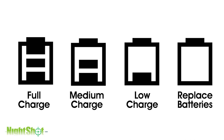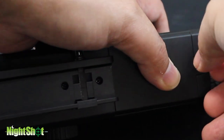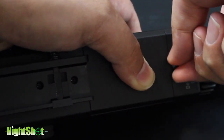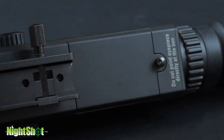Power display and battery life. This device uses four AA alkaline or lithium batteries. When the battery voltage is too low, the device will not operate. Expect approximately three hours of battery life under normal use with alkaline batteries. The use of quality lithium batteries is highly recommended, as lithium batteries will significantly increase battery life. The IR uses the majority of the battery power, so if the IR is left on, the battery life decreases significantly.